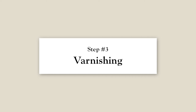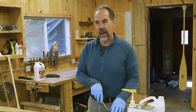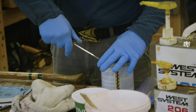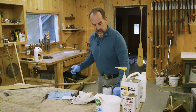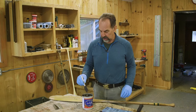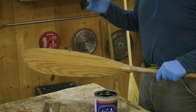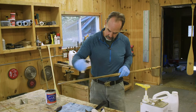There are many types of varnish on the market, and there are other wood finishes too. I like to use a good quality spar varnish on my paddles. You can buy a pint of varnish and it'll be good. There are a couple of different kinds of brushes — a good quality bristle brush is great, or you can use a disposable foam brush, which actually works surprisingly well. Varnish wants to be applied in thin coats. If I have too much, the finish won't cure properly and it really won't adhere underneath. More thin coats are better than one thick coat. Then I'm going to hang this paddle back up to dry.